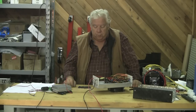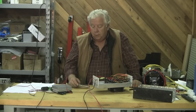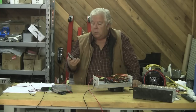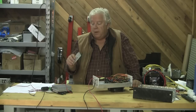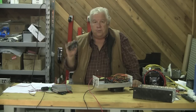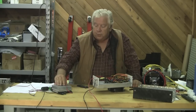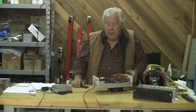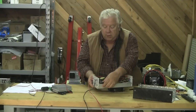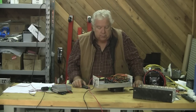The voltage is set to about 12.8 volts — a 90K resistor gave me 12.8 volts. These bricks have one main issue: to get that full 500 watts output, you can't just use the brick bare. You have to heat sink it. Get some aluminum heat sink material, mount the brick on it, and screw it down tight. You want to use a little thermal grease, ideally, but it's not entirely required.